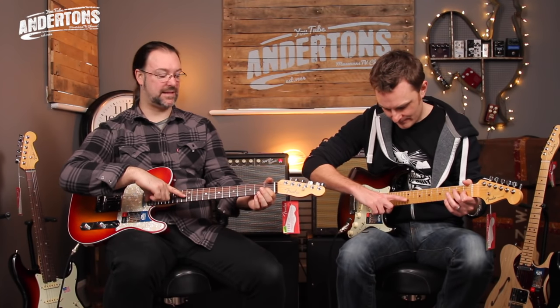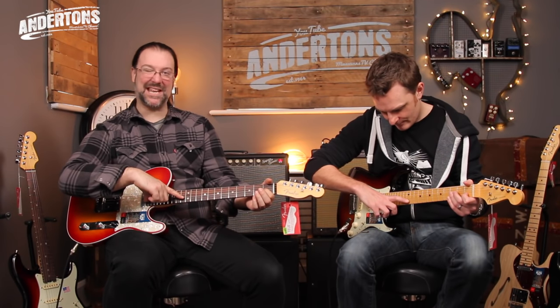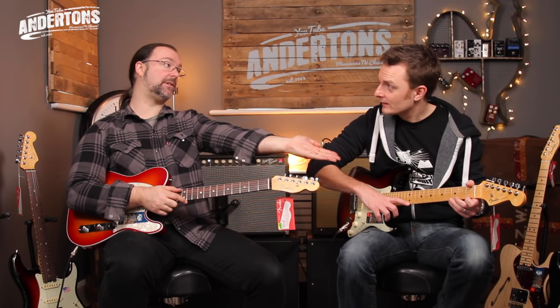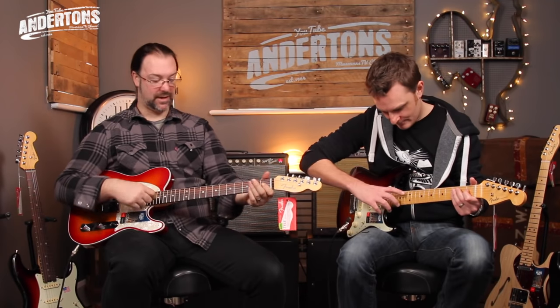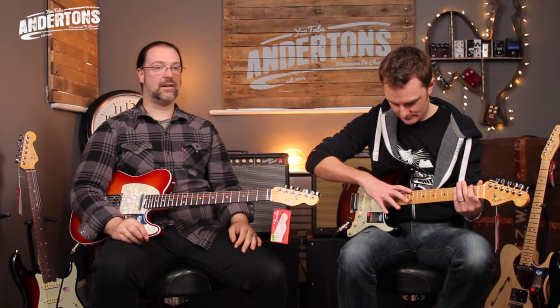Yeah, I agree. That is how much relief is in the neck that you want to play with. If the string is just dead touching the fret, the neck is too straight or slightly too far that way. And you would want to relieve it and bring it back towards you. If there is maybe 2 mil bounce in that string before it touches the 12th fret, then it's an awful lot too much relief and you want to slightly straighten the neck.